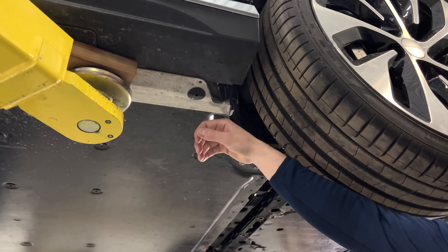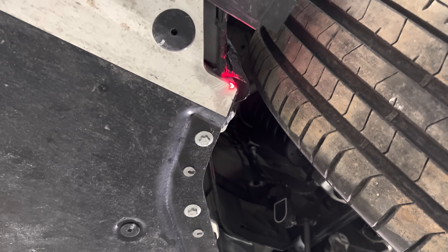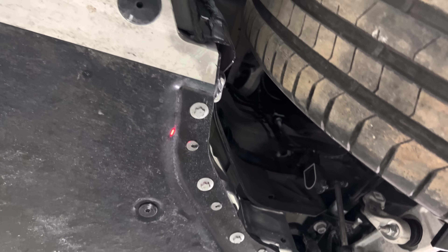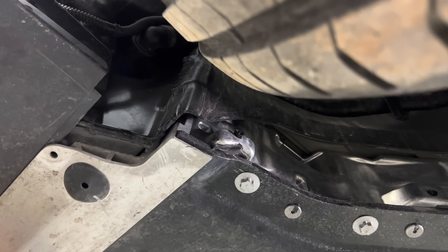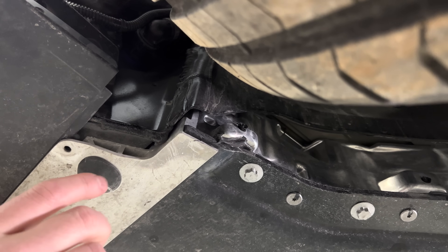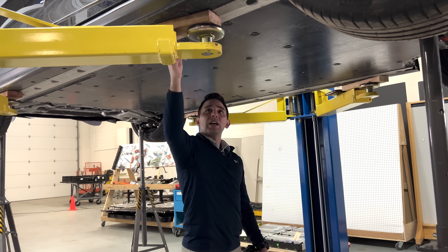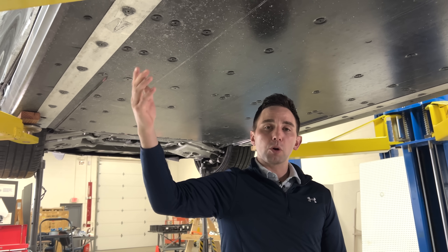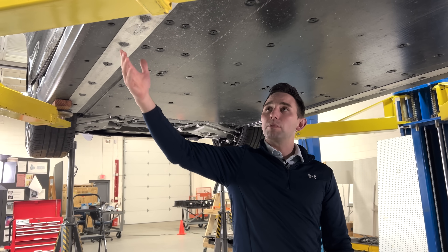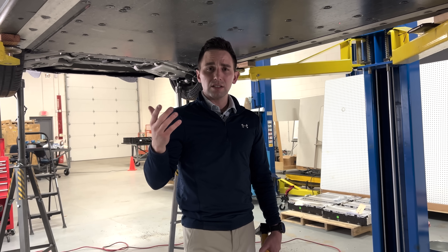As we go to the outboard side, they've capped both sides of the battery pack on the outboard with aluminum extrusions. It is interesting looking at how they nested the aluminum extrusions around that bottom panel. If you look at this little joint right here, that aluminum extrusion actually slides over almost like tongue-and-groove style, and then they put some structural adhesive to really ensure that those two are bonded together. Not only did they put structural adhesive, but if you go inside of the aluminum extruded section, you would find fasteners coming in from the side in the Y-axis that are attaching to the actual side rail of the battery. So this is mostly a side pole protection — an additional structural monument to help absorb energy and react against the barrier, especially for the new IIHS 2.0 or updated side pole tests, whereby the barrier is lower and it's a more difficult test to score well on.